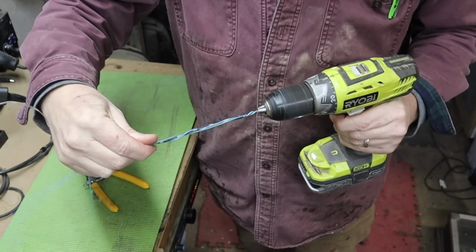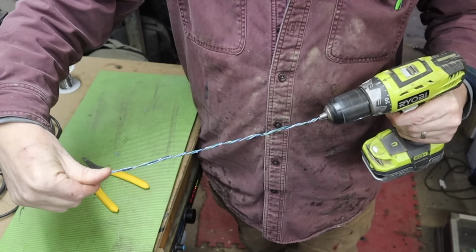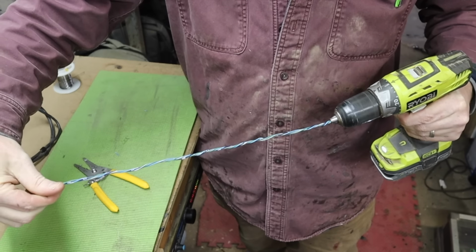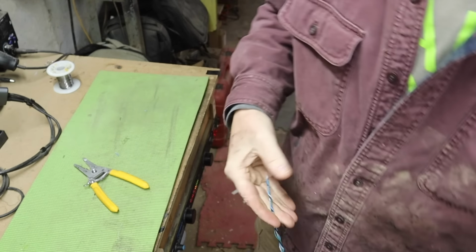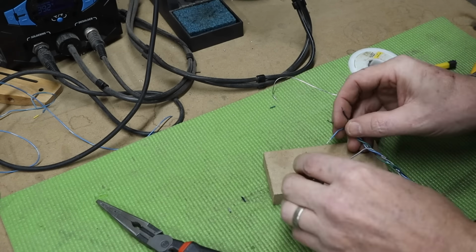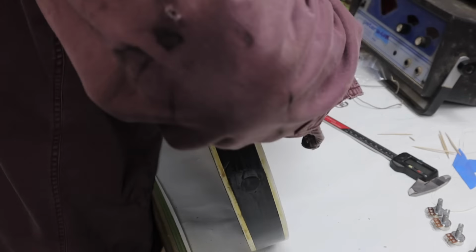You have to wire this guitar in a specific order, starting with the wiring harness to the three-way toggle switch that gets buried under the pickups and everything else. And this is just a little trick if you didn't know this: you can very quickly and easily twist wires together to make your own harness. So I started by doing that. I soldered the switch in, then I put all the electronics in and just copied the standard Les Paul wiring with the dual volume and tone knobs.